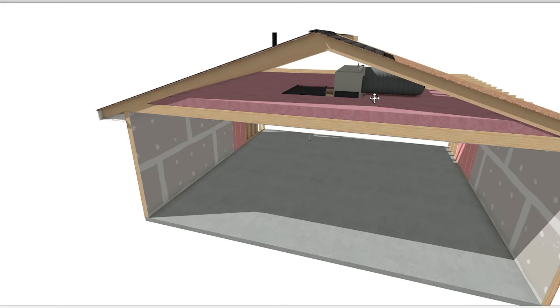When we design a ventilated attic for Texas, we need to hit an R38 attic. If you get way up north, you might need R60, so you're putting in a whole lot of insulation up there on the ceiling.